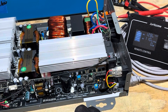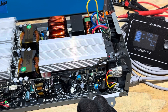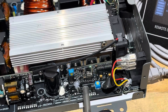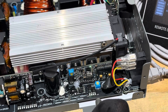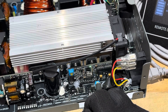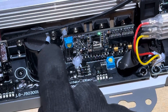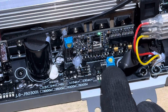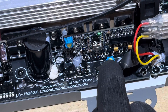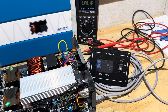I noticed during the initial review of this inverter there were two different variable resistors on the control circuit right here — trim potentiometers, if you will. I took a few minutes and studied how this is laid out: VR1 labeled here, part of the control circuit for this inverter. What I found is this right here should be our voltage adjustment — right here — to change the output voltage. If you notice, there is a sealant right there to lock down the adjustments and also kind of serve as a tamper indicator. If somebody made a warranty claim and they saw you were in here fiddling around, they could tell that's been broken or moved from the original position. So I'm going to adjust the voltage up.